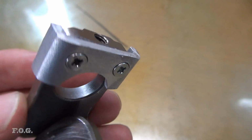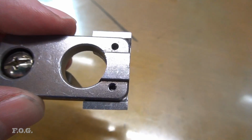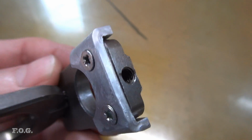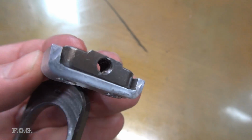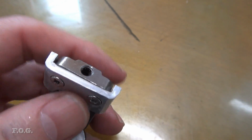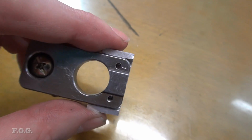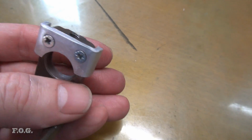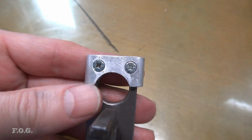So there you go, that's it there on there. You can see the hole is clear on that side. And obviously when I screwed those screws in, I made sure I didn't screw them too tight, otherwise it would break again. The hole's quite deep actually. I think the screws don't go through all that deep, but yeah, I think it's going to hold it on there. I mean, this is only to hold the piece on there so it doesn't split apart. The main force is these bent ends here, and I think it's going to do the job. I think this grub screw now will function, and we can get it on there. It's not too bad, right? Anyway, if you do manage to break it, this is probably a good solution, I think.